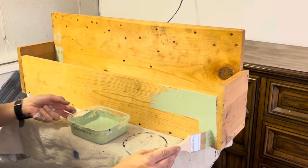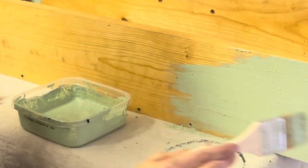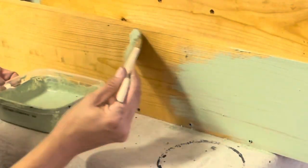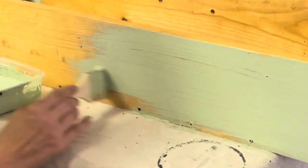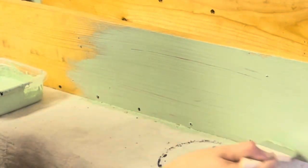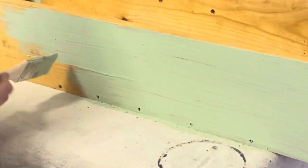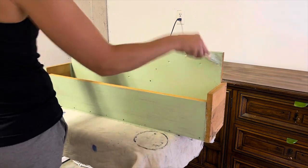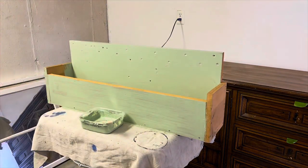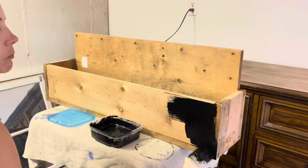I'm using a plain old chip brush to apply this milk paint today — I don't mind if there's a little bit of texture through this paint. You'll notice the consistency I mixed it: it's not running completely off of the wood surface, but the paint is also moving. If you're finding that your paint's not moving around, it's probably too thick. If it's completely running down and off your project, it's probably a little too thin. You can adjust accordingly by adding more water or more powder. Just make sure you mix it well and always let your milk paint sit for a couple minutes before you use it.